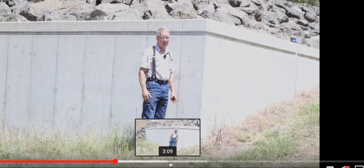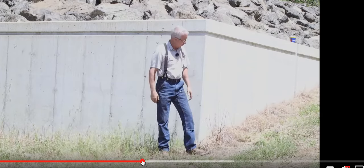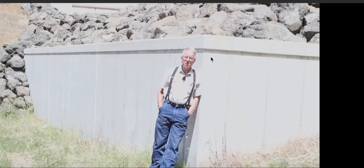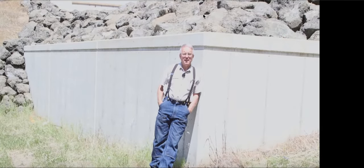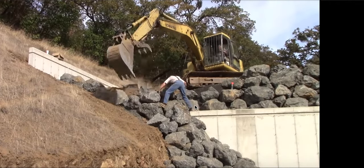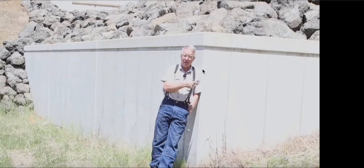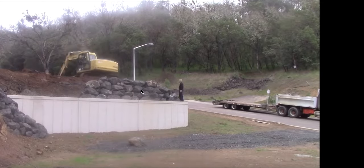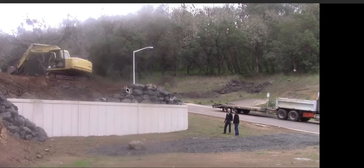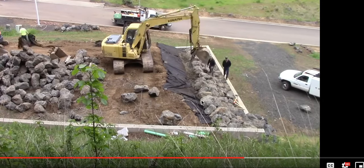There's another alternative: if he would have formed the corner in a radius and softened it, forces would have distributed better. The other mistake made was having to restack the rocks at a shallower angle due to a three-way miscommunication — he needed to reduce the slope, the pitch on those rocks. Somebody came forward and shook them out, putting the load on the wall and reducing the fall hazard from an 18-foot cliff. In laying the slope back, he had to give up about six feet of lot size in both directions, and he already knew the lot was tight.